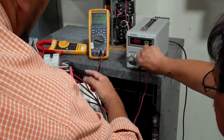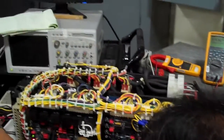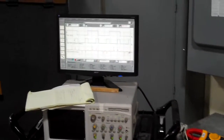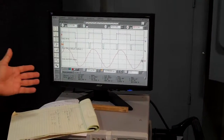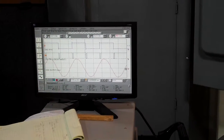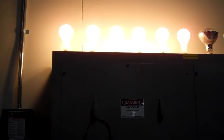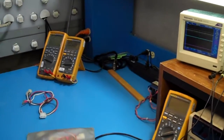Okay, can you bring Chi back to 0? I'm going to move now between T1 and T3. We're going to do it again. Enable. Okay, we still got that 0. Go ahead and bring it back to Chi. So again, the unit is controlling at about 9.7. It's a close to perfect sinusoidal wave. We got the lights balanced, at least to the visual eye. We don't see any significant imbalances, and we still got 471 on the output.